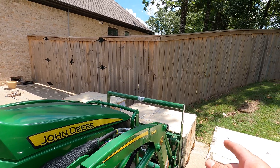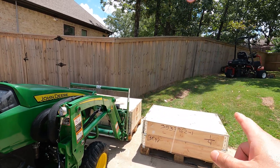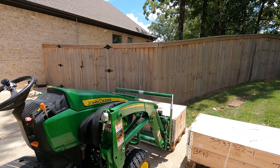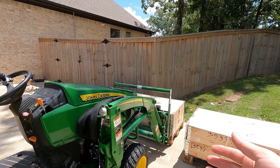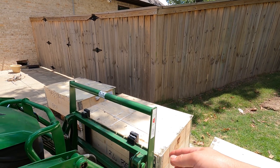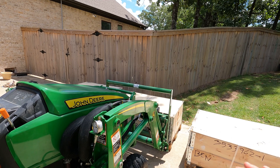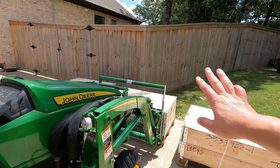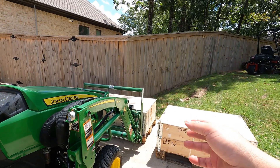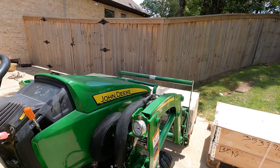What I'm going to do is lift this 428-pound crate, see what the difference in pressure I get, do some quick math, and then stack all three together to see how close to 1335 we get. Yesterday the pallet I was lifting was really narrow, about the same distance from the pin as the bucket, so it was close to one-to-one. I expect this to be less than one-to-one — one PSI is probably going to be like 0.75 or so — because the weight is further out and you have different points of leverage. You'll need to benchmark this with forks and with a bucket separately.